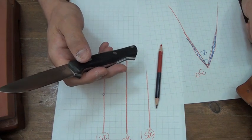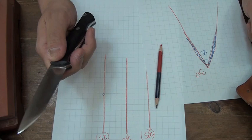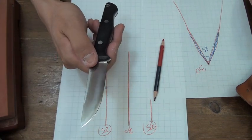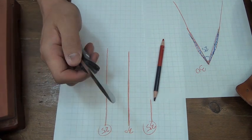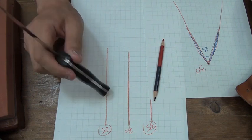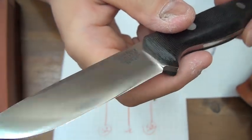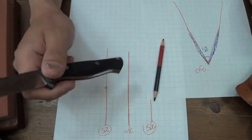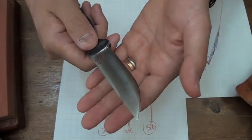The only irregularity - not a regular one - was 3V Bushcrafter and Bravo One. Regularly they always come with problems at 25-degree or smaller. A2 is okay with 25-degree angle, it doesn't take any edge problems during deer dressing - very sharp and tough in A2. But this 19C27 Swedish Sandvik stainless steel was not as tough or hard as A2, so it took micro rolls after initial use in deer dressing.